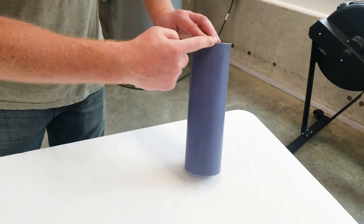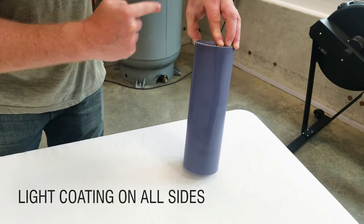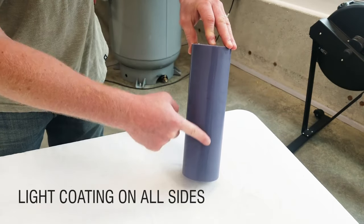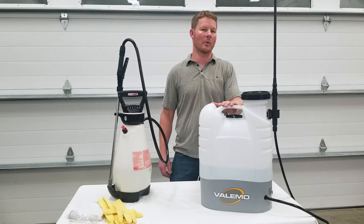Disinfecting solution is cheap, so using 70% less is a big deal. And this is sufficient to coat all sides of the surface due to the electrostatic process going on inside the tank. When an area and objects are sprayed with the fog of solution, the positively charged solution will fall and be pulled into the negatively charged surfaces, coating even the backside and inside of objects — almost magically.